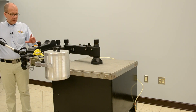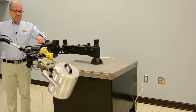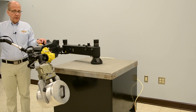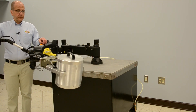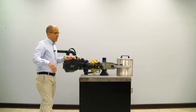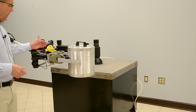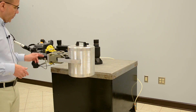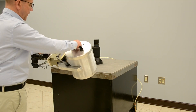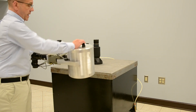It's the revolving head member — we have 90 degrees down and 90 degrees back. The operator can pick up the work piece, do whatever is needed, and lock it in place. Built into this head member is also a rotation with a detent pin and four 90-degree detents around this axis, so that if the operator needs to reposition the part, it can be done by pulling the detent pin and manually rotating.